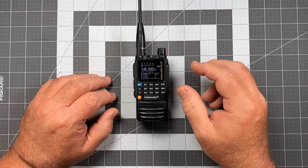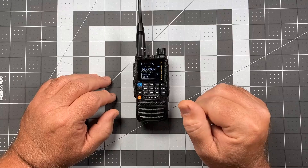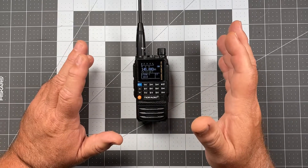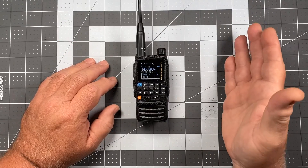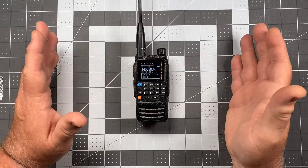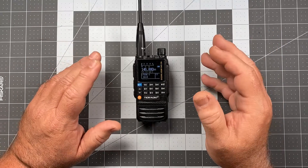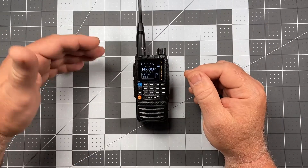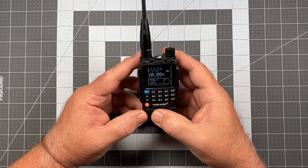So you've got to kind of fiddle with it. I've had a couple of radios — not necessarily the TDH3, it doesn't suffer from this problem — but I had some radios in the past that I thought were completely deaf. I would put one radio next to another radio and one radio is hearing the signal and this other one is not picking up anything at all. In some of those cases that can just be because the squelch level is too high, so it's keeping out even those strong signals from coming through.